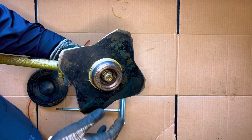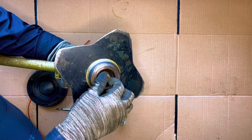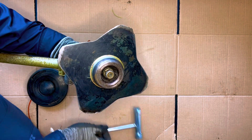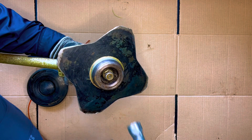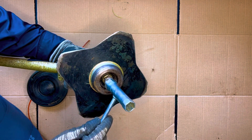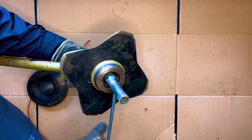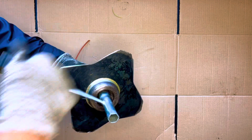So while you're still holding that pin, make sure that this doesn't shift, because if it shifts it's going to give you a whole lot of vibration because it's off balance. This tool you're gonna need — or you can probably get a substitute — but these things are easy to get. Your STIHL dealer should have one or it should already come in your package. Just continue rotating.